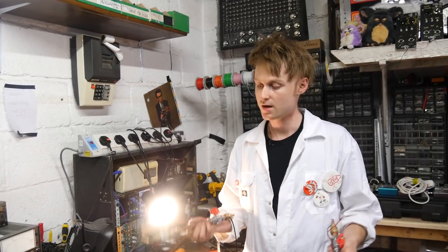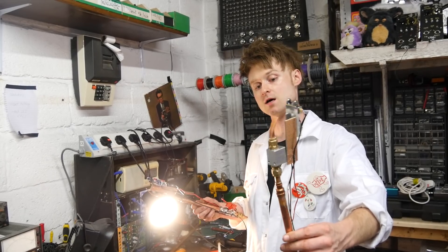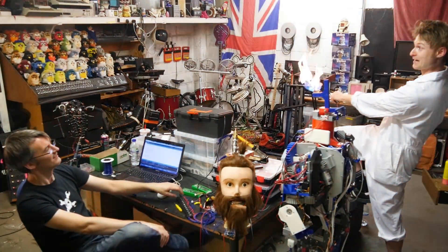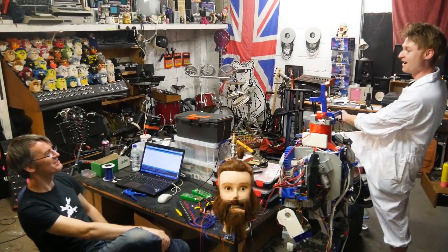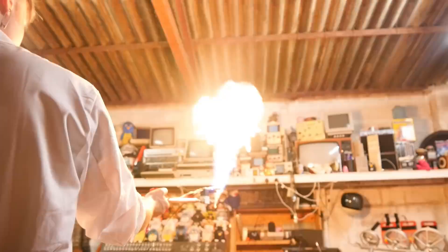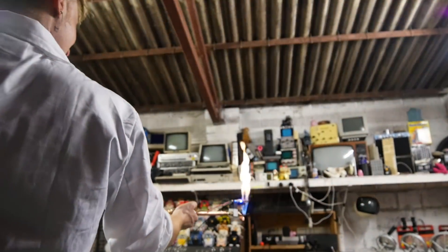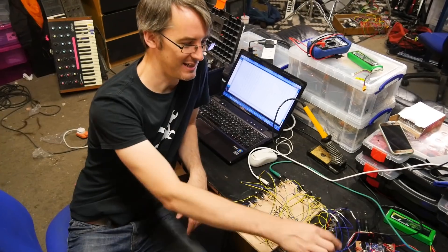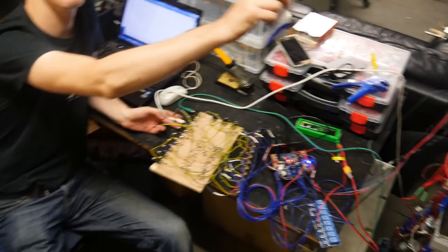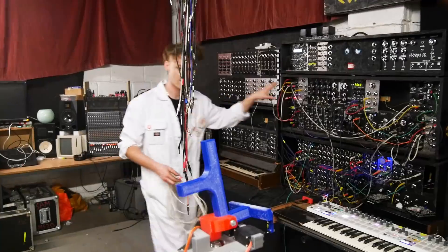Two flamethrowers for the arms — nearly complete. They're basically the same as the one that's in the mouth, but they aren't because they're for the arms. At least it lights every time now. So we did have the analogue pots — we've now put these breakouts in so we can plug the jack cables in. Those go analogue into the Arduino, and that sends the data to the robot to move all the axes, including serial data for the arms and the servo data for the head.